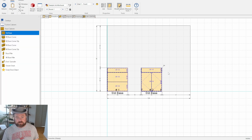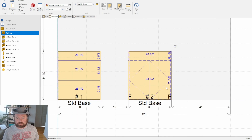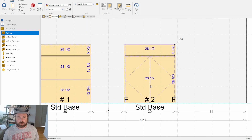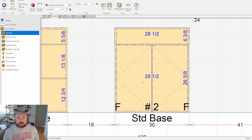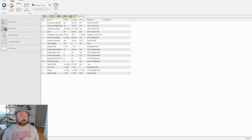Let's bring in a standard base. With a 28 and a half inch opening, if we go to Reports — let's go to an increment that's more understandable — take our slab doors: if you add your widths together, divide by two, and compare to the door sizes, you should have whatever reveals you set on either side and then your sixteenth-inch gap in the middle.